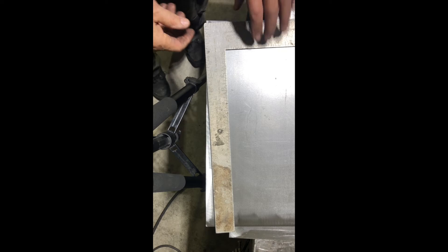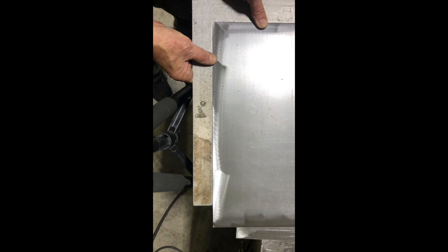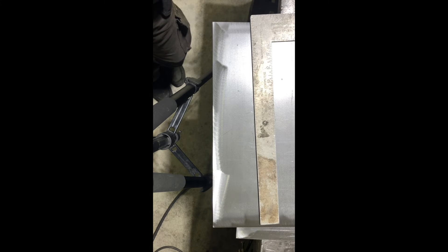After making that lead screw rotation adjustment, let me show you what we've got. I am very close — there's probably about a 64th of an inch that I could still correct, but it has solved the problem. So in hindsight, I probably should have done that originally instead of moving the rail — although you need to be careful if you make too much of a change in that lead screw from one side to the other, you could wind up with those bearing blocks getting in a little bit of a bind. So maybe it's still good to adjust the rail best you can to take most of it out, and then make the last final adjustment by doing that lead screw trick.